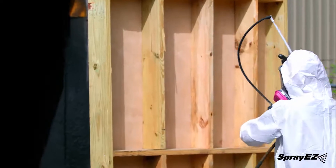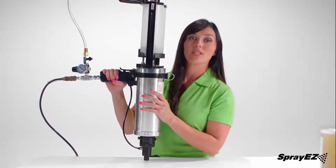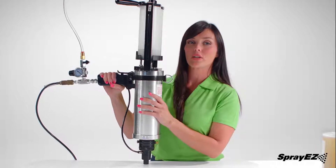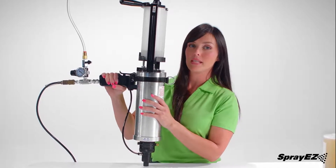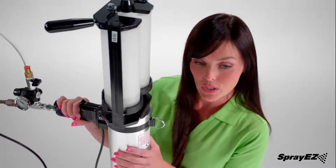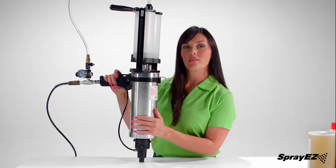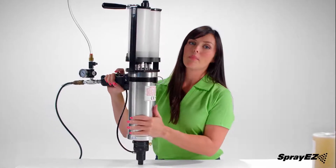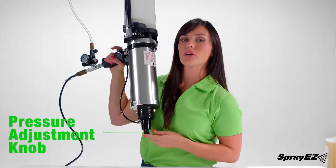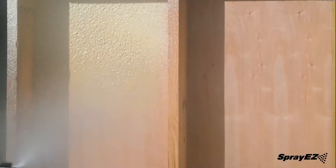When the rods move the material forward, it goes into the static mixer. The air atomizer gives it the proper spray pattern. To turn this on, you must turn the valve and pull the trigger at the same time — this must be done in conjunction. If you don't, you risk the material going into the static mixer and hardening prematurely. Before spraying the foam, the pressure adjustment knob must be turned all the way clockwise; if not, it will cause the material to harden in the static mixer because the rods will be pushing it too slowly.